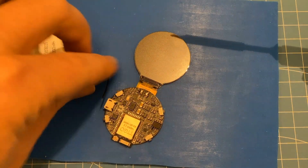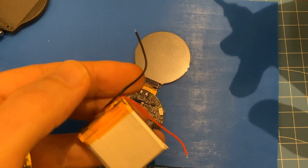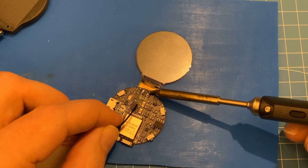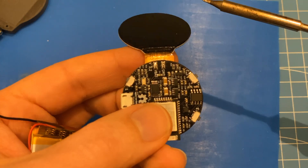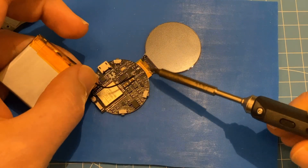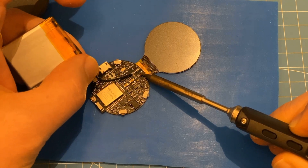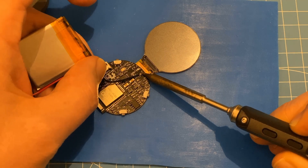Because the ground plane is harder to solder, we're going to start with that one. Make sure to bend the wires really far away from each other, and then we can take our time soldering the ground pin first. The ground is this one and this is the plus one where the red wire will go. Heat up the pad. To be honest, I really don't know what I'm doing — I taught most of this myself by looking at YouTube videos, so I'm not a professional, be warned.